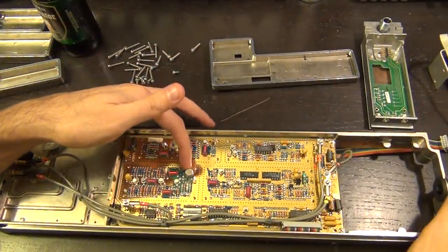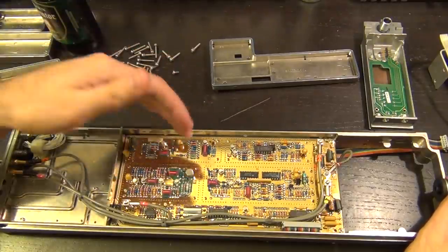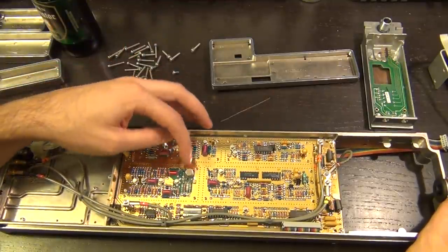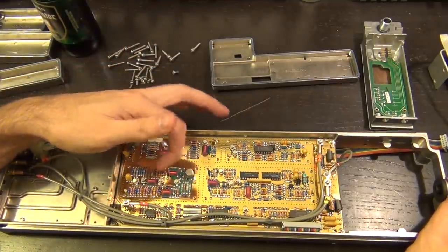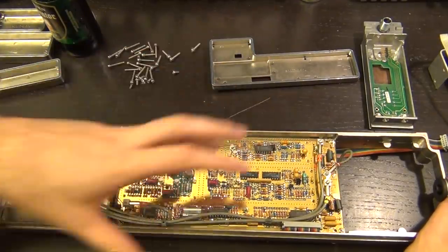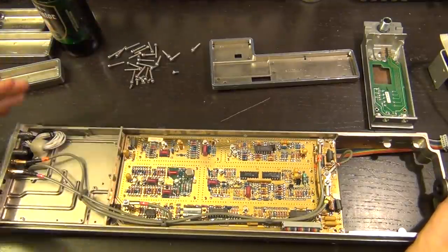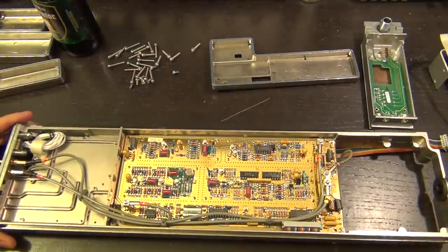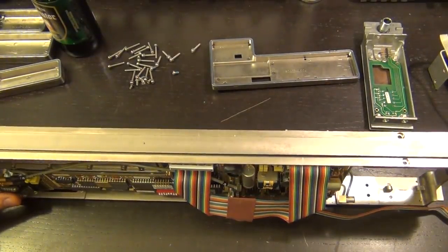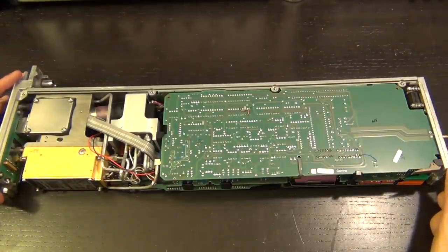This was actually made in the United States. The label has '100' with six zeros in front of it — so it's a 100 MHz oscillator that is externally tunable, perhaps with varactor diodes, and that's how they make the PLL with a charge pump phase detector. I'll have to do a tutorial on PLLs some other time. We're pretty much done with this one — let's go to another module.